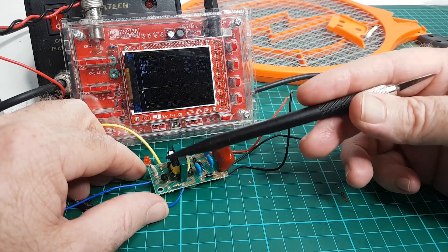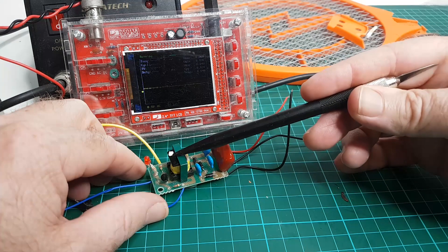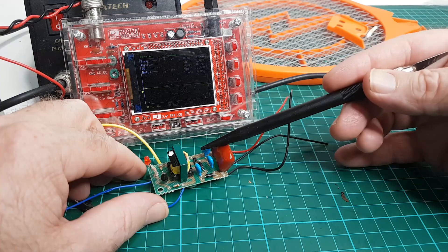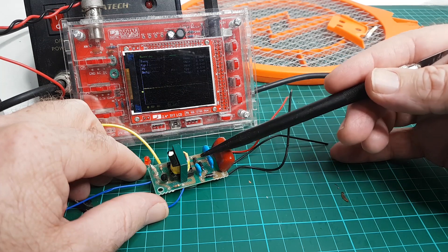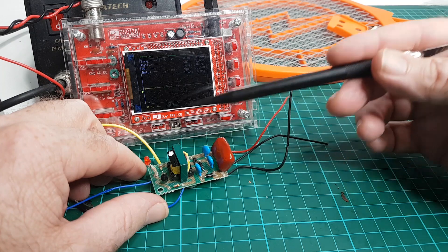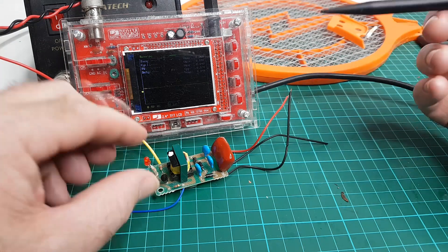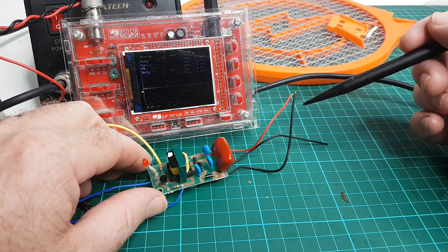It's interesting that you've got both a step-up transformer and a voltage tripler. Using a tripler must be a more economical way of achieving high voltage rather than adding more and more caps and diodes to make a quadrupler or an octupler. And this would make a fairly effective stun gun circuit, really.